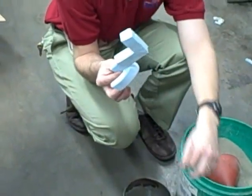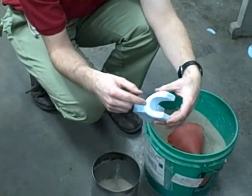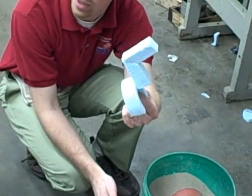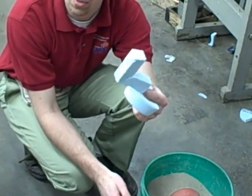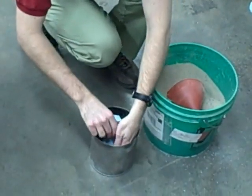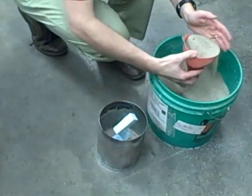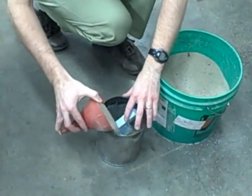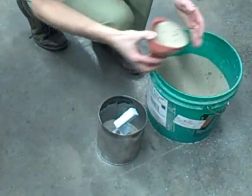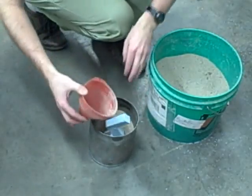I've got my actual pattern now. This is for the bottom piece of the fuse slicer. This is the actual product I'm going to have — you'll fill this entire cavity with aluminum. I'm going to place it in here. I've got rubber cement in there. I'm going to use this funnel kind of as a scoop. This is sand — actually just regular sand you'd use for concrete.